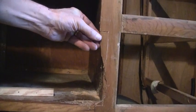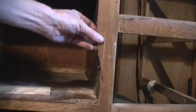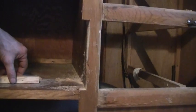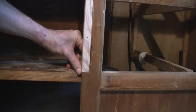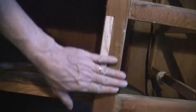Here's the part of the closet that was eaten away. I've cut out the top and the bottom to make it straight so I can put a block in there, cut a block that'll fit, and tack that in. Then a little veneer over the front, and I'll just stain this edge to match the rest.